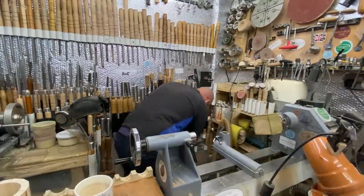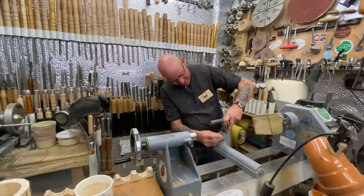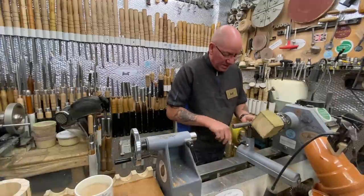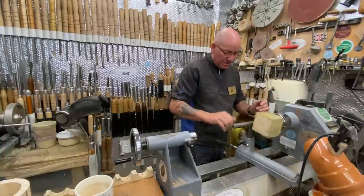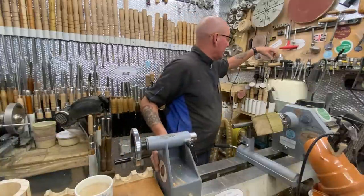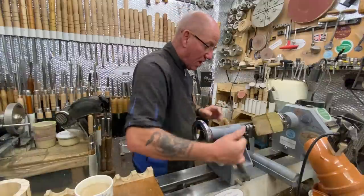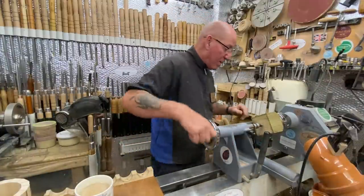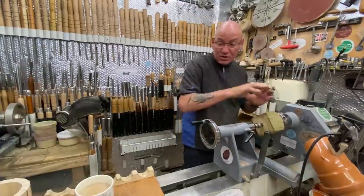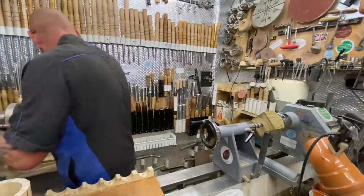Right, okay. Let's get a tool rest on. And let's get what we're here for. Do some turning. Right, okay. Now, all I've got to do is... Yep, that's all clear. Take this end down, so that I can fit this in. I'm going to bring a step center up because the reason being, it's not overhanging a lot. I don't think I'd need it, but this is just fence post. Fence post wood isn't that great. The tenon could break, so I'm just putting that on for a bit of security. That's all. Just until I get the first bit taken down.